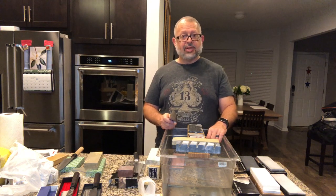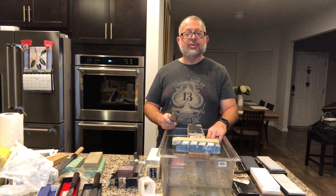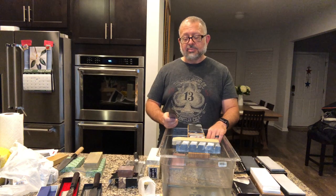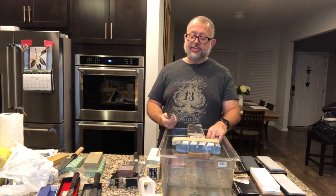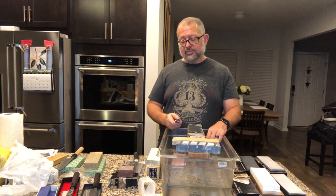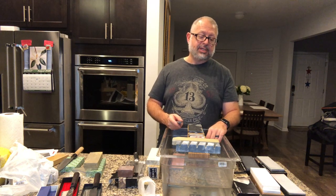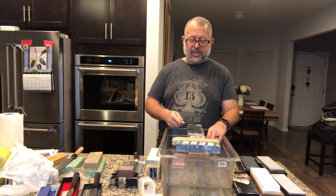So you definitely might drop below your 1,000 and go to your 400 or 220, but you're destroying a knife if you're using something too low for something unnecessary, because you are removing metal that cannot be replaced. If you respect the knife, if you have any type of affinity for a knife, don't do extra grinding just because you're tired. Go to sleep, wake up, and do it again the next day.